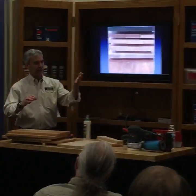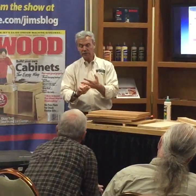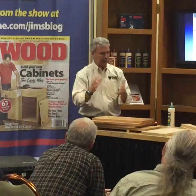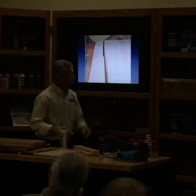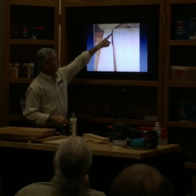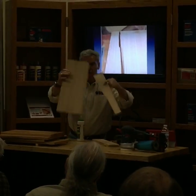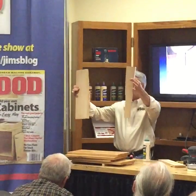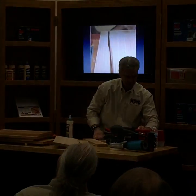Okay, so I've jointed this on a table saw. I washed the glue joints off, hardly put any pressure on this, didn't do anything that you're supposed to do, no biscuits, no dowels, no splines. And here's the idea. When I broke this board, the one that we've been showing in these pictures, it still would not break in the grain line, or in the glue line. It broke on a flaw in the wood, or a character flaw in the material or something like that. So this is what happened here. And I actually had my wife do it.